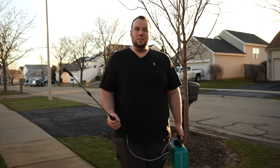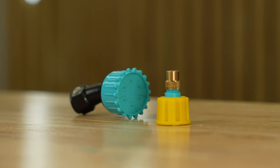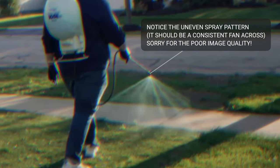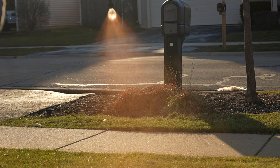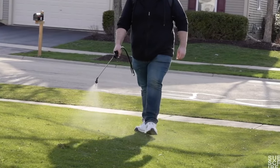So the next standout feature about this sprayer is that it has the ability to customize its nozzles. Now I'll be honest — the nozzles that come with this sprayer are pretty trash. You can see how the cheap subpar spray tip doesn't produce a consistent fan pattern — it's more concentrated in certain parts of the fan, which can lead to a highly uneven application. Versus when you use one of these cheap $7 spray tips, you can clearly see how much more even the spray pattern is. When you're applying highly concentrated herbicides, the last thing you want is an uneven pattern because it'll lead to over-applying in some areas and under-applying in others.